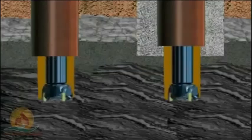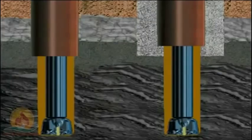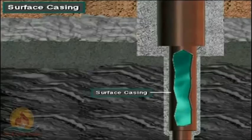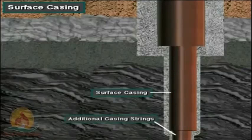Using a bit whose diameter is small enough to easily go inside the conductor casing, the rig drills the hole below the conductor to a prescribed depth. The diameter of the surface hole can still be relatively large, say 17 inches or over 400 millimeters or even more. The surface hole's depth is usually set by regulatory agencies, which require that the surface hole be drilled through all freshwater zones and that surface casing be set and cemented to protect those zones. This depth could be from hundreds to thousands of feet or meters. Crew members nipple up or connect the BOPs to the surface casing at the wellhead, so this casing must be strong enough to support the BOP stack, withstand gas or fluid pressures the well may encounter, and support the additional casing strings hung inside of it.